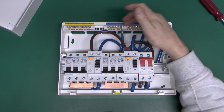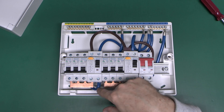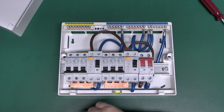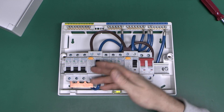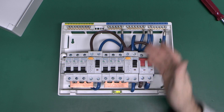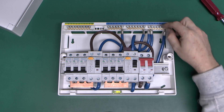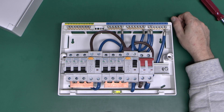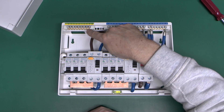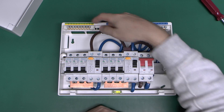The reason there are two separate neutral bars is because any current that goes through here onto these three circuits has to actually return via this RCD - otherwise you're going to get that imbalance and one or the other is going to trip, and in some cases both. So for every RCD you need a separate neutral bar. This one has additional terminals over here, so that if you wanted to put a circuit breaker or other device in here directly from the main switch, that would connect to the third bar at the top there. And for all the circuits, the earth is the bar at the top here, so your incoming earth would connect on one of the terminals here.